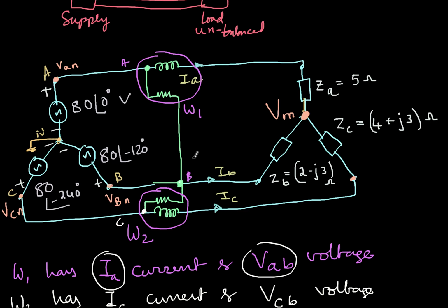Now with this combination, what will be the total power is again what I want to check. So let me leave a comment here. Connecting 2 wattmeters in A and B phases, whereas C is common. So let's save and then I'll just run it once again. So again, you notice that here the W1 is 462.73 and W2 is 3958. So this is the different combination. And what is the total power here? That is this one, 4421.6, which is exactly matching the case. So even in this case also it is coming.